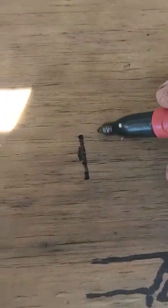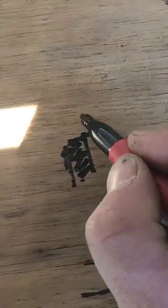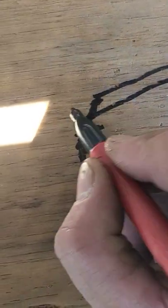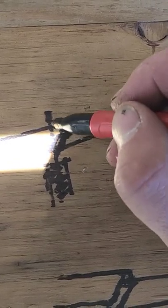So let's say you're doing interior trim, right? And you've got a stud, there's your stud. In a perfect world, the short side of that material lands on the stud, and your long side overlaps it, and you'll just run one fastener, or one row of fasteners, through the baseboard and into the stud. And you only need one, because that's going to suck that top piece down tight enough to pull the other side in with it. And that's fine for interior stuff.